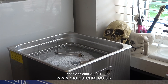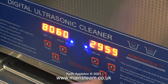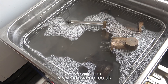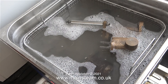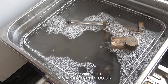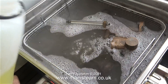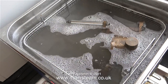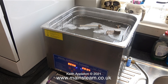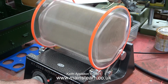I set the water temperature to 80 degrees C — it's currently at 60 because this heater isn't all that good, but it does keep the water hot. I set the ultrasonic cleaner to run for 30 minutes. One viewer commented that my ultrasonic cleaner should not make a noise like this, so I checked by watching a couple of videos featuring this model, which is the 15-litre unit. The smaller ones don't make much noise, but this one does because I think it has more ultrasonic transducers. I didn't really have enough of the carburetor cleaner, so I added some other stuff which removes oxidation very well and coats the parts in something that tends to prevent rust — it's very much the same as Evaporust. I repeated the process and ran the unit for another 30 minutes.